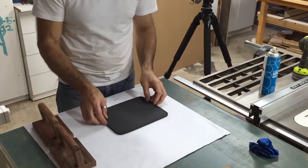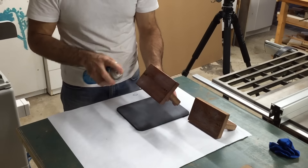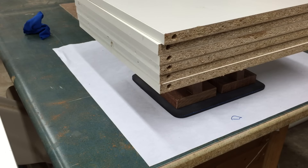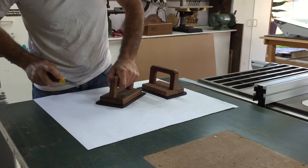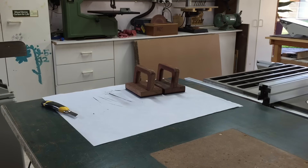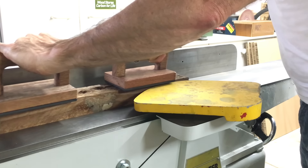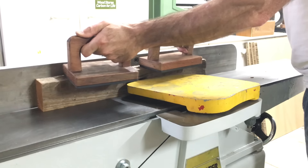The last thing to do was to put the pad on. I used some computer mouse pads, pulled off the blue felt — didn't really want that on there because it would come loose anyway. Used some spray adhesive on both surfaces, weighted it down and left that overnight to glue up. Next day I came back and trimmed off the rubber pad. And there you have two homemade push blocks.